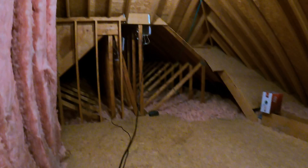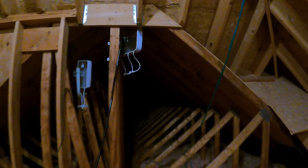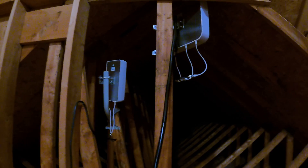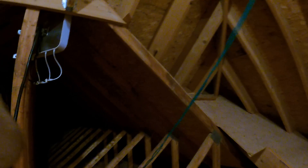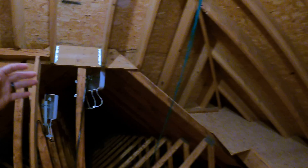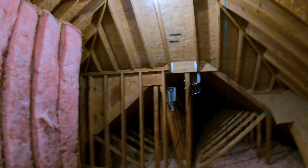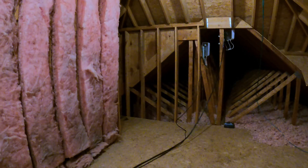We're up here on the third floor loft — here is the door to the attic. In here I have the antennas and cabling. I have both a 4x4 and a 2x2; I don't typically use the 2x2, that's for testing and comparison. Here's the 4x4 — it's mounted on the stud and pointing through the sheathing and shingles. It's obviously better if it points through nothing at all, or through a gable end, but this setup is fairly easy.